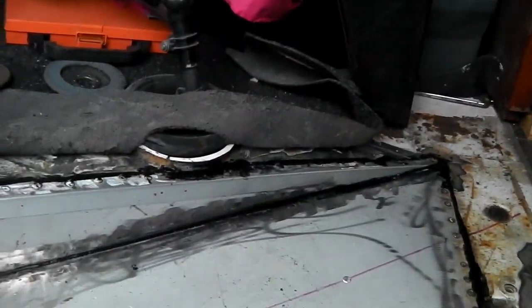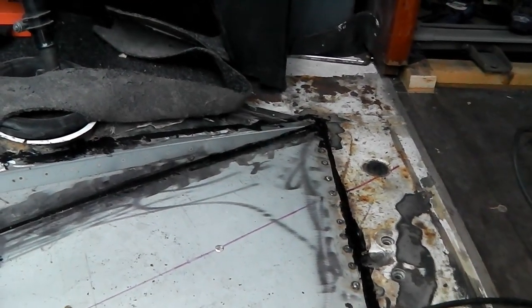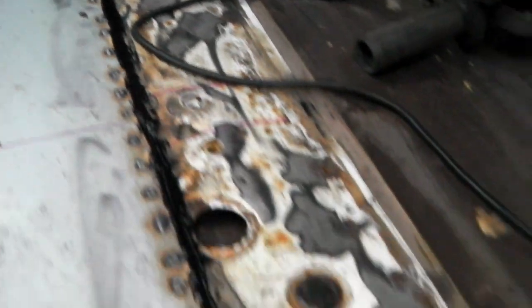The inside of the wheel arch wasn't too bad. I've red oxided everything just to preserve it a bit. Be careful when welding that you're not burning into any pipes or cables in there - I was very careful. Also the opportunity came to bleed the clutch because it was just underneath this floor, so I bled the clutch and changed the fluid while I was there. This black goo running the seams is seam sealing - the old U-Pole tiger seal.